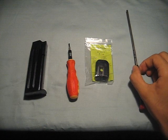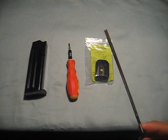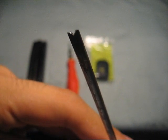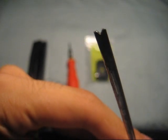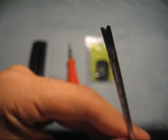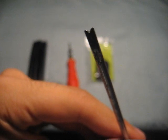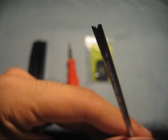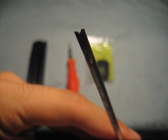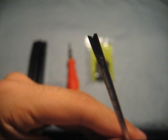Last, it would help if you have a special tool — this is a flathead screwdriver with a cut in the middle. It's a flathead screwdriver that has been ground in the center with a triangular file. This tool will capture the magazine spring from the inside and push it down, keeping the magazine spring coil captive without slipping, where a regular flathead screwdriver would slip all over the place.